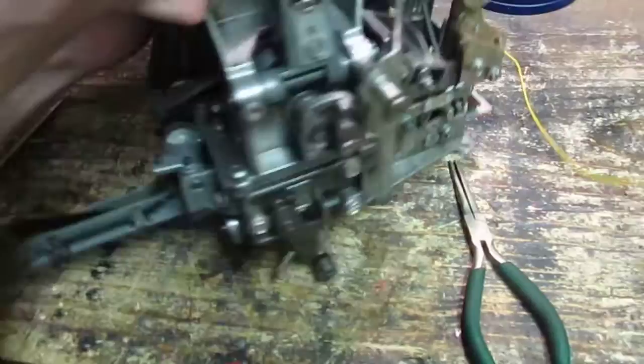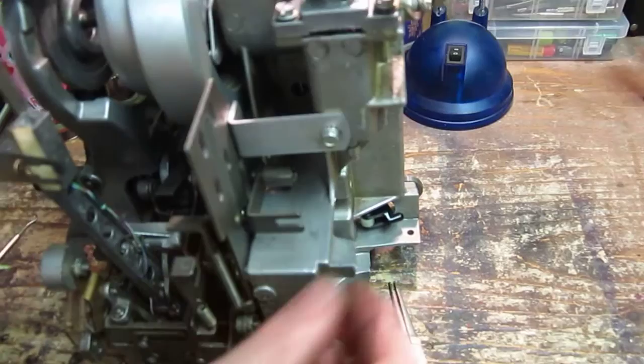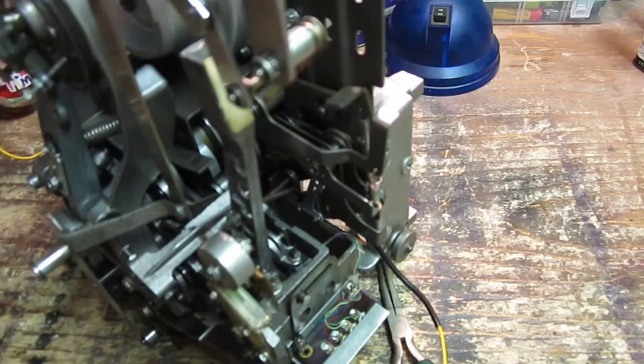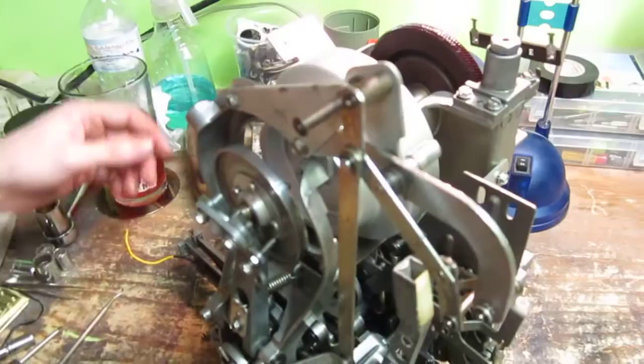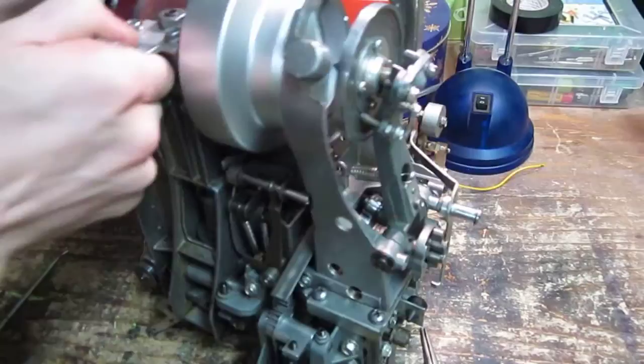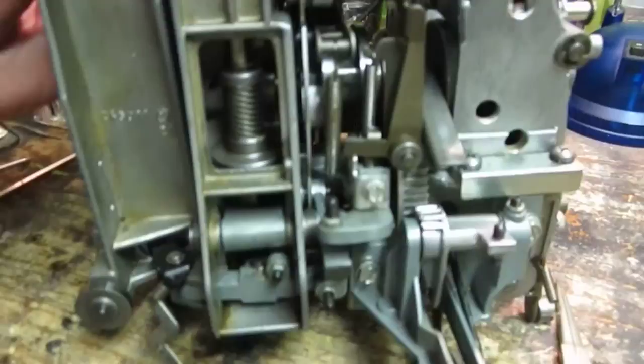So this is all together — you've got your tone arm in place. To get into detail on how this works: normally there is a solenoid here which pushes this lever up. When it's in pickup and drop mode, and when it's scanning there is a timing contact which tells it when and where to pick up the record. The Tormat unit tells it at which spot to stop to pick up the record. I'm going to turn it so I can see a bit of lever action — if the time runs out I'll just do this in the next video.